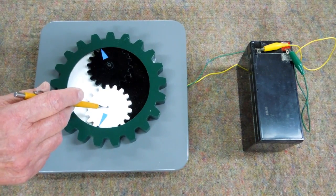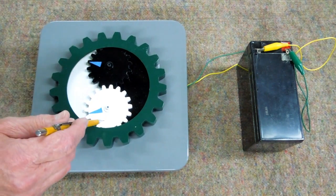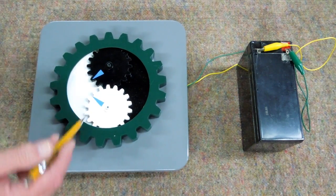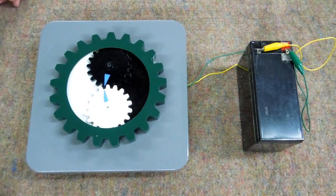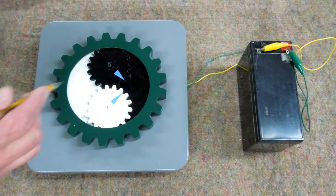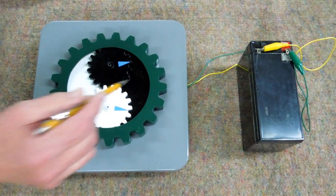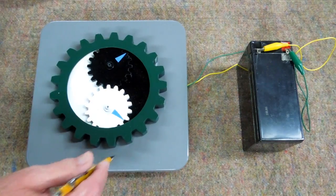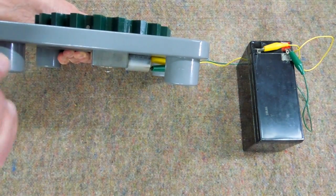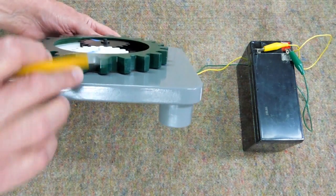This is turning three RPM. This gear is driving this gear, and the other one behind this spacer is driving the ring gear which is attached to the big gear. The plastic washers are holding these gears up high enough so they don't rub on the paint on the spacer. That cardboard shim behind the backer plate is holding this high enough so this gear does not rub on this paint.